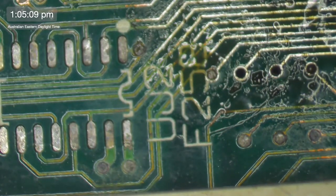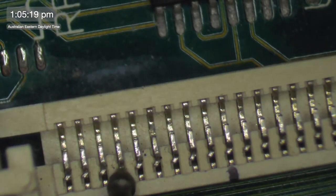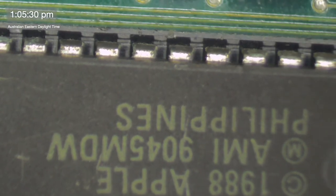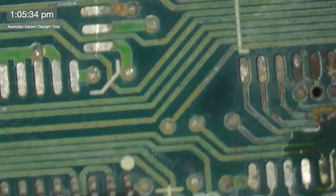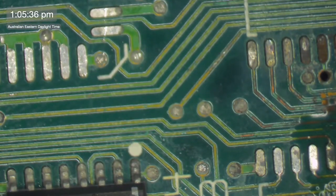And then let's check him at the video ROM, see if he's getting there. These pin seven. So 1, 2, 3, 4, 5, and then we go across here to 1, 2, 3, 4, 5, 6, 7. Yay! Okay, so we know that one's good as well. So we're making connections on the inside of the board.